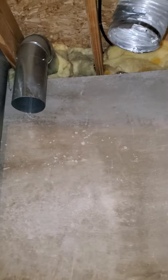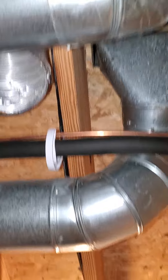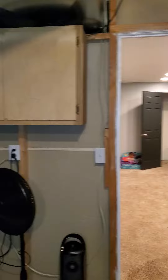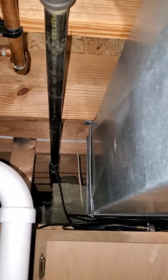Electrical — I'm gonna see where the circuit is up there for the dryer. If we can, I want to see if we can reuse this circuit right up here, pull it down and bring it over here to the wall. If not, our panel's over there. We have ducting here that we can fish through to the other side and bring the circuit over here from the panel.